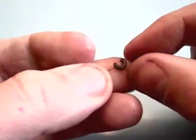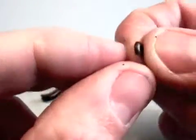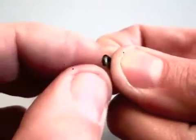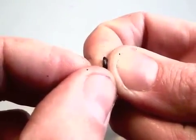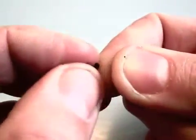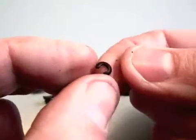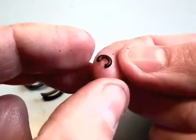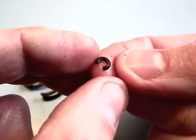The seal which most often goes on your air gun is the inlet valve seal. That goes because, if you look how misshapen that is — when you're filling your air gun up, the air around this seal actually gets excessively hot, probably up to 100 degrees plus. So you're filling your air cylinder quickly, the air goes in, it's excessively hot, and there's a lot of pressure — thousands of pounds per square inch. It just cooks the inlet seal and absolutely knackers it. It's the most common repair any gunsmith anywhere in the world will do on a PCP air rifle — replace that seal. The best thing to do is to fill your air gun as slowly as you can, just stand around and wait a minute or two whilst it slowly fills up, and that will preserve the life of this seal.